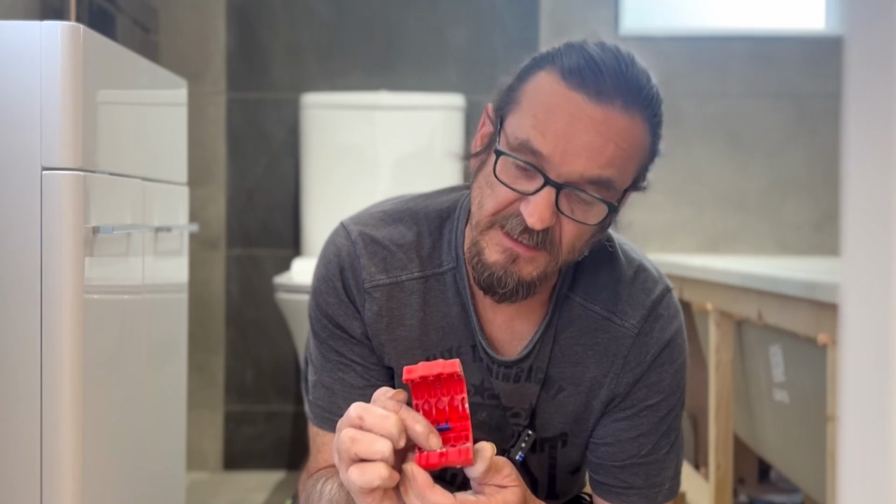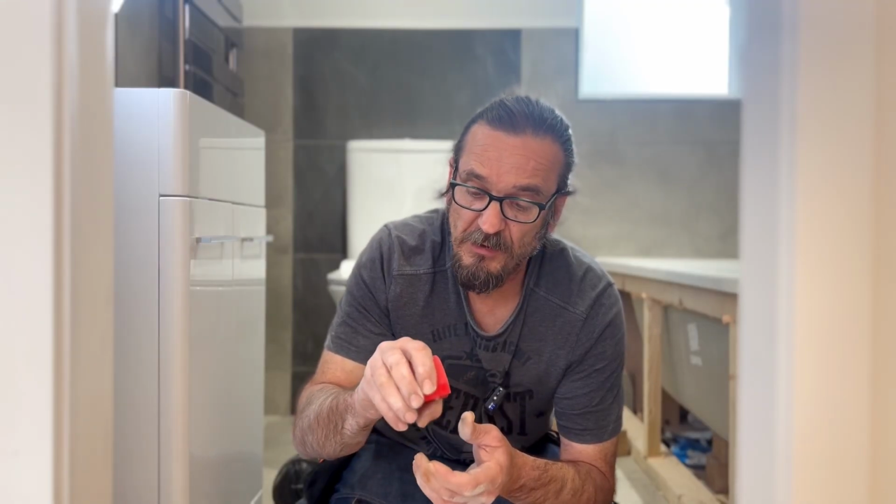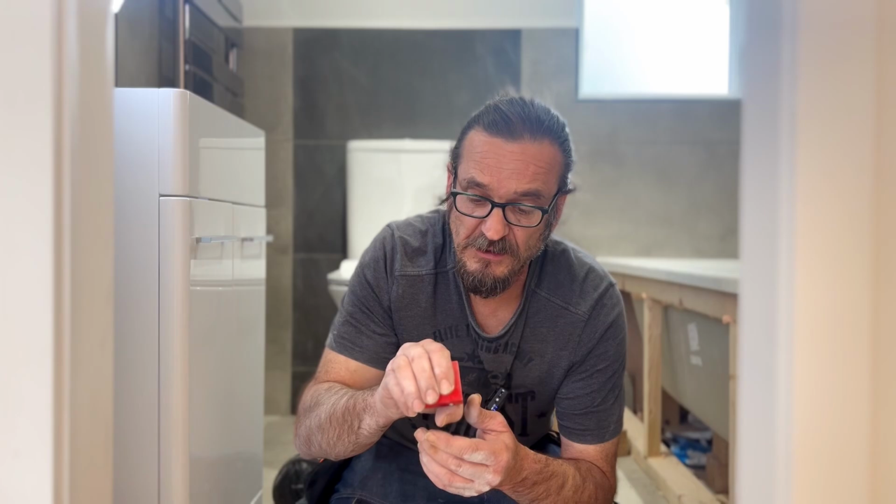That blade in the center can be moved towards the side of the BIX to get a tighter cut when you're cutting against the wall. The problem people are finding is when you do use it on that side edge, it's sort of cutting a corkscrew cut, so it's not cutting nice and straight. The problem is, when people are applying pressure, they're applying pressure to the whole BIX, and it's sort of tilting it slightly. So if you've got that blade to the side, you need to apply pressure above the blade, not on the side of the blade, and that will give it a uniform pressure and cut through nice and easy.